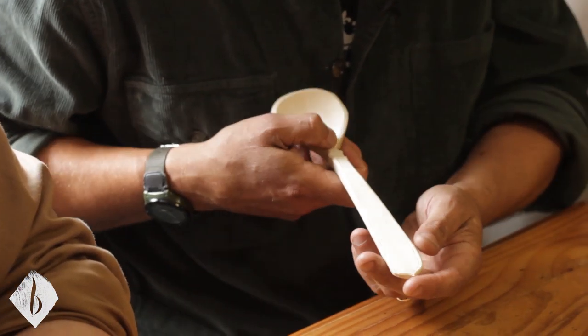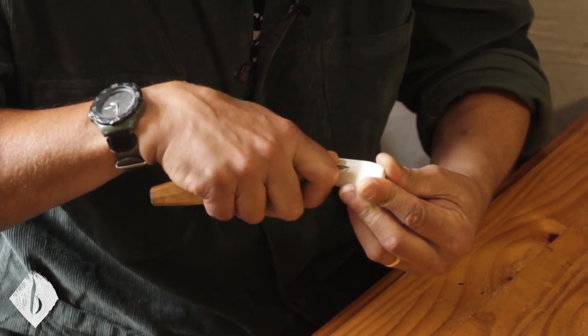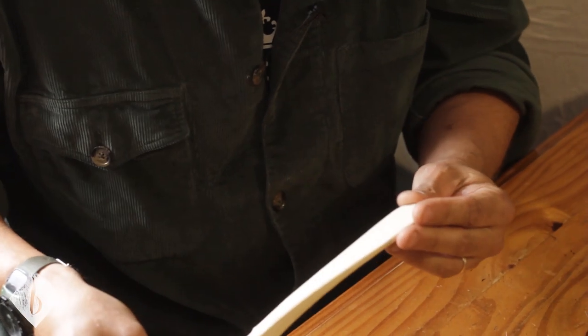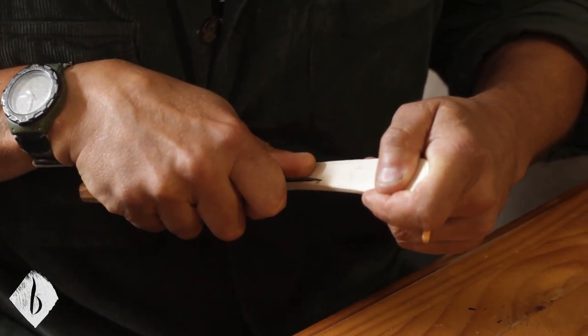The freestyle carving concept is that I have a frame, and now I won't draw anything. I just take the chip carving knife, decide on whatever point, and make a bent line freehand like that. And then I'm going to build a whole pattern out of this line. So I continue from that stopping point and try to get a bent curve again.